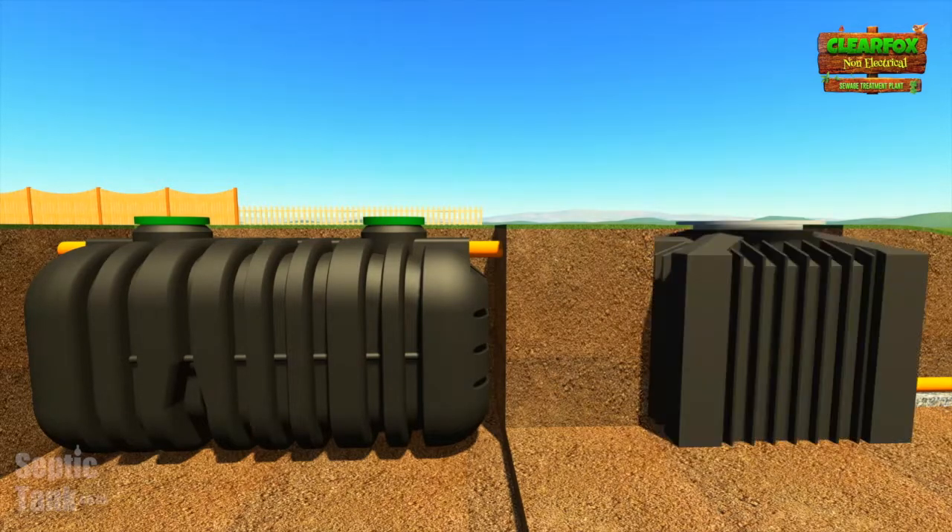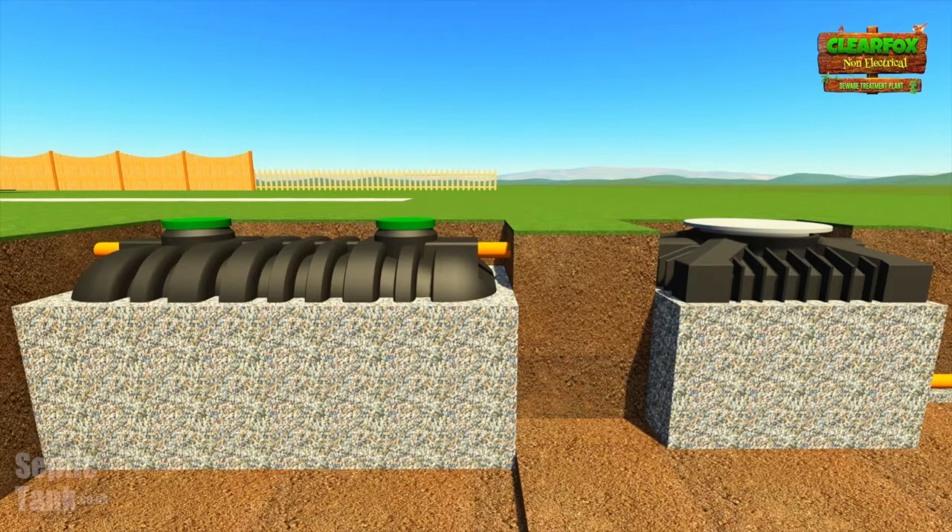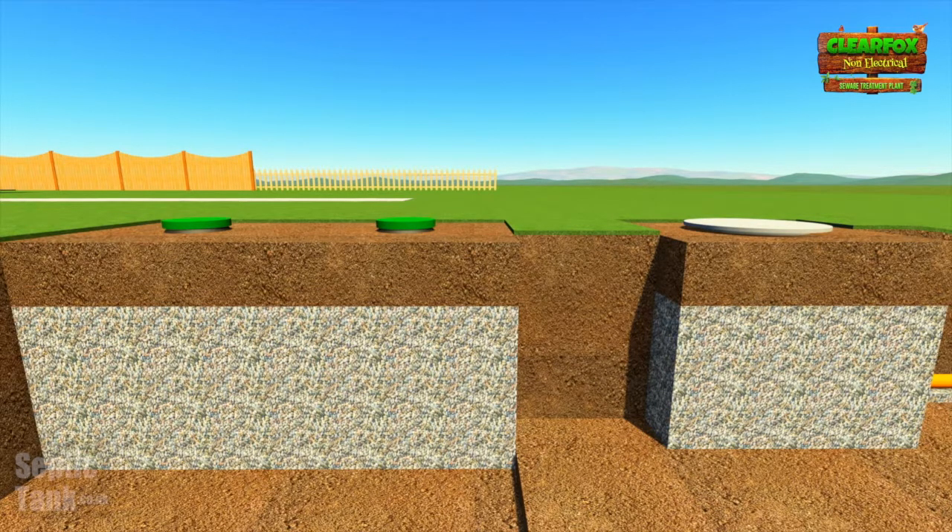And because of the special heavy-duty design and construction, it means that it doesn't crush like a coke can. It's not weak — it's very strong but light — but can be put in without any concrete, so again you'll save another five, six, seven hundred pounds in concreting costs. You can backfill around it with sand or 20 to 30 mil granular backfill.